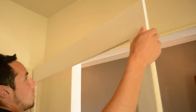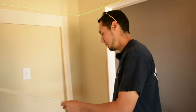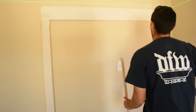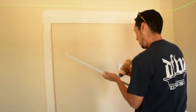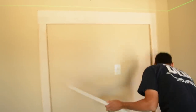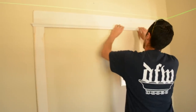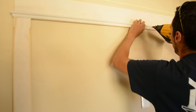There's the panel molding that's going to go at the base of the header. I went ahead and put some 5/8 nails in my 18-gauge — those small nails so they're not going to blow through the back when I install this. I'm going to put some glue on the back, just a small bead of glue to help it hold over time. You always want to dry fit this first before you glue it just to make sure. So I'm going to hold this in position and work from one side to another, shooting into the panel molding.